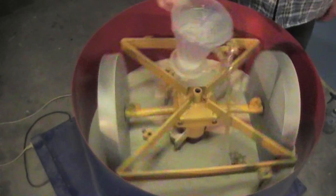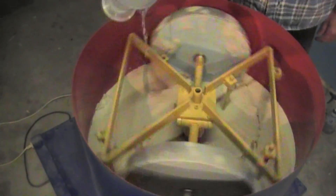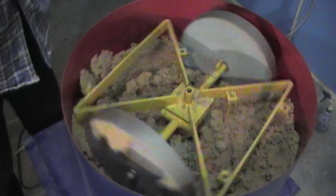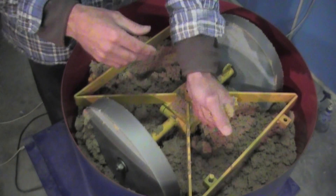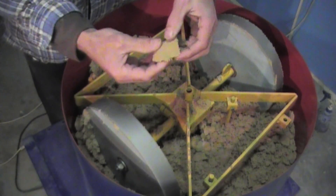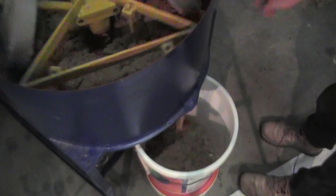Using the sand muller is a lot easier. Basically you're just tipping your ingredients in, turning it on, letting it mix for about 5 minutes. Once it's all mixed thoroughly through, just slowly add your water. Once all the water's added, just let it mix for about another 10 to 15 minutes and stop the mixer. Try your sand — basically it's supposed to break evenly with nice clean cuts, not break into little pieces. This batch is probably a little bit wet; I did add the 800 mils of water because it's going to sit overnight and I probably won't use it until tomorrow. If we're happy with the final result, we just remove the little trap door from underneath and all the sand will fall into the bucket below — and now it's ready to use.